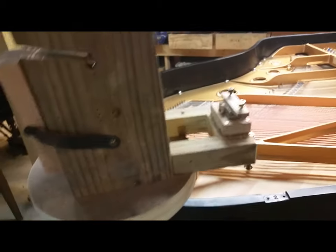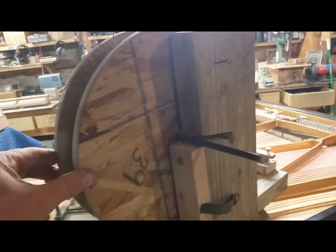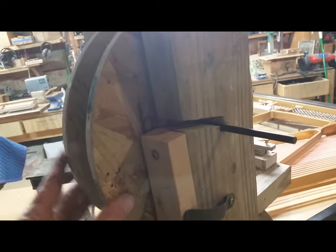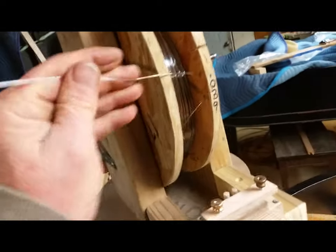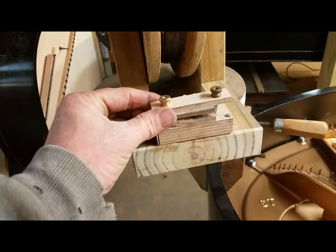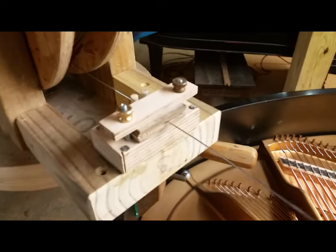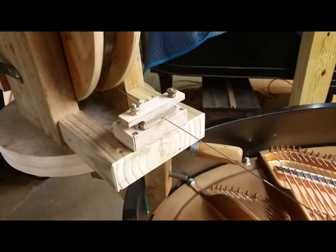The spool is loaded on the back part of the dispenser — just push it forward and it's ready to turn. I'll feed the wire through the string brake. Music wire is now in the dispenser. You can see on the string brake I have it set to where it doesn't grab too much — it grabs a little bit. I could tighten it down so it won't pull through at all, so it's completely adjustable. You can see the music wire going through the two wooden guides.